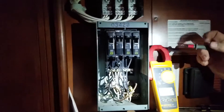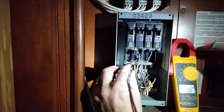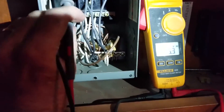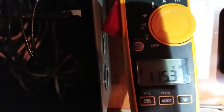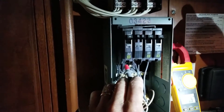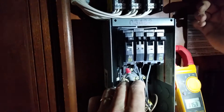So now we're at the end of the trip. We started the whole thing referencing neutral to this side. We can see we have 115 volts, and look — they're all on. So in the beginning this was a problem. We identified the problem as an open neutral down below. We put the new wires in, and now we can make hot chocolate in the microwave.